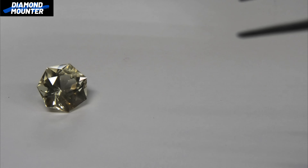I was thinking about the stone yesterday - I remembered more of a point on them and was going to do a V-claw, but looking at it today there's such a shallow angle that it's not really worth making a V-claw. Instead, I'm thinking of a quite chunky round claw with enough meat on it to actually file facets on the claw so it matches the outside of the stone - sort of faking a V-claw. Because the angle from the side is quite steep, I'm also thinking a cone shape to cone off these claws to match the design flow of the stone. Just got to make it meaty enough to put a flat on the top half.